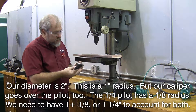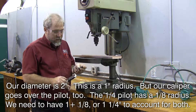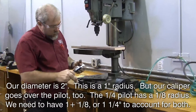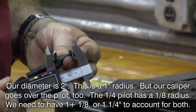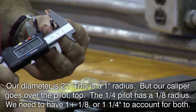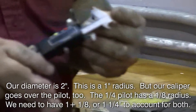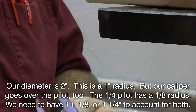It's time to cut the two-inch circles that are going to form our flanges. To check the size of our circle cutter, we're going to use our caliper and go around the outside of the quarter-inch pilot down to the inside. This should be a one-inch radius plus the radius of our quarter-inch bit, so it should be one and an eighth of an inch if we're going to set it in the proper range — and it is exactly one and an eighth of an inch, so I don't have to adjust it.